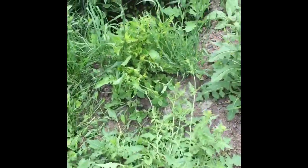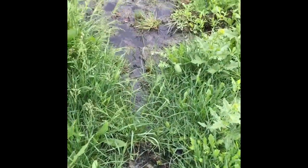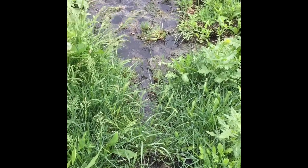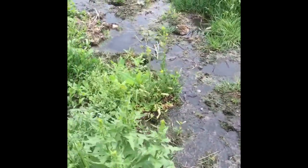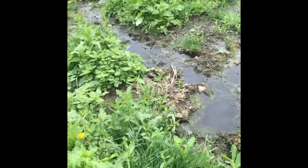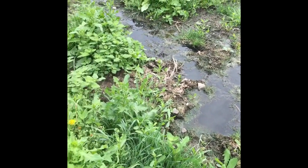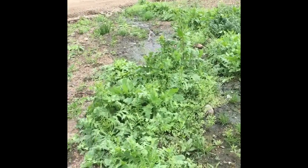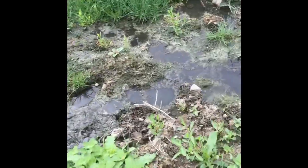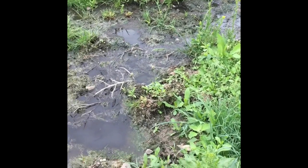As we make our way down from the distribution box to check the trench overflow, there is no more water trickle — the water has stopped and is now settling, being absorbed into the soil. Our next order of business is to contain this: we need to bring a little bit of sand over top, and then some topsoil, to ensure this doesn't continue to run down the bank and stays safe.